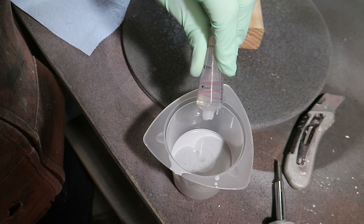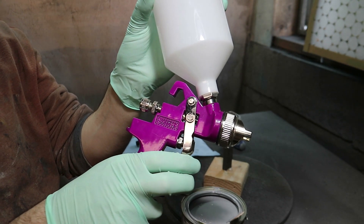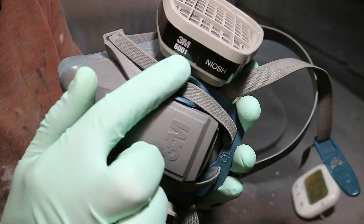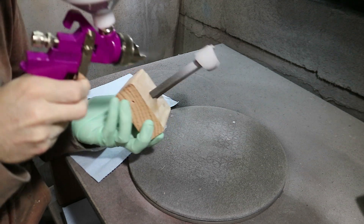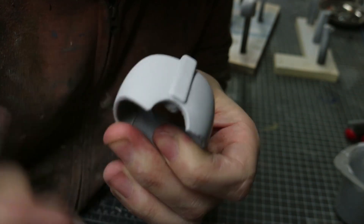On this build I did something a little more advanced when sealing those parts. I used a catalyzed filler sprayed through an HVLP gun — this is the sort of filling you do on an automotive application. This stuff is called Feather Fill, and it's kind of like a liquid Bondo, which also means it's fairly toxic. It gets sprayed on in two or three layers to fill in all of those print layer lines, then it's left to cure for an hour or two. Once fully cured it can be sanded nice and smooth — a bonus to this stuff is that it sands like a dream. I'll go into more detail on the Feather Fill in a future video.